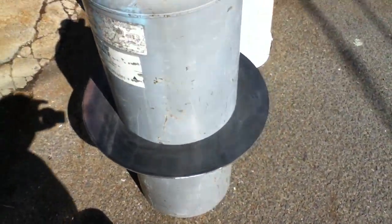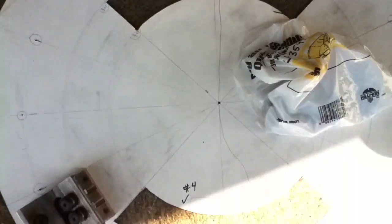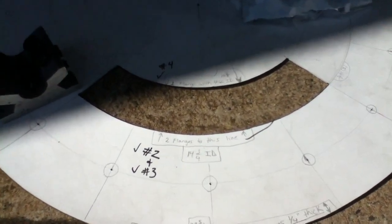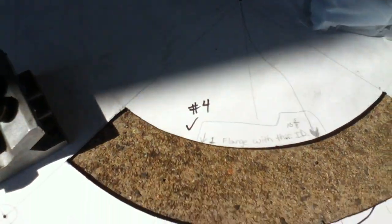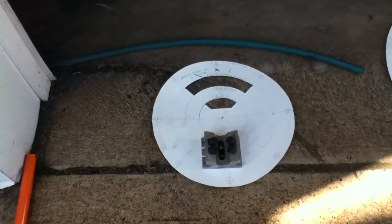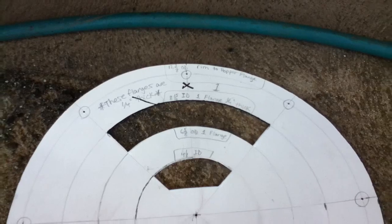The one around the hopper itself is flange number three. When we look at these templates you'll have a reference for how I did this. I had a center punch mark for the center of the circle and cut out different inside and outside diameters for different flanges. I'll try to zoom in so you can see any information you might need if you were going to attempt something like this. You hold the scribe on the center and rotate this template around — really the outer one is the only one I used.